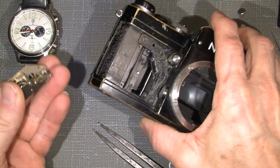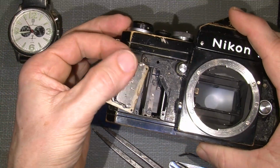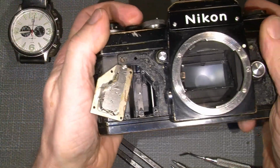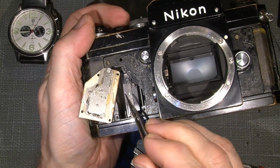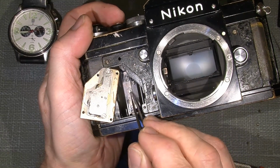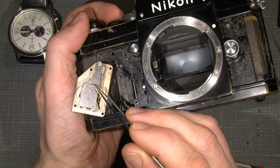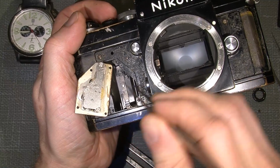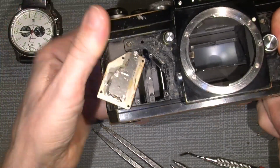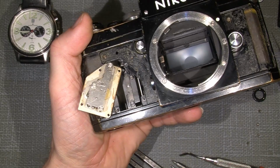Now, the self-timer pin, just put it here. The pin from the shutter button up here goes down here, and the pin from the self-timer that activates the shutter mechanism is this one. So this pin that can be moved by the timer will push on this side, so we can do it again. By pushing here I can activate the shutter.